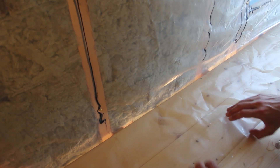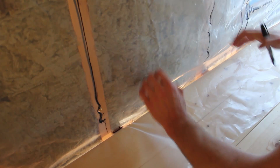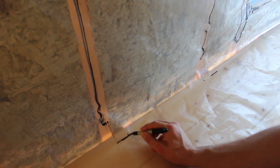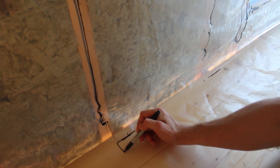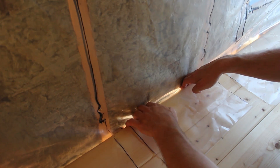With the sheet up on the wall and trimmed to a workable length, I'm ready to do the slits. There are joists right under here, so I'll poke the sheet down tight against the joist and make a mark. I'll elongate the mark so it's about halfway across the stud, so that when I go to tape it, there'll be exposed stud for the tape to stick to. Then I'll make a rough line, cut that out, and tuck this flap down, repeating in every space.